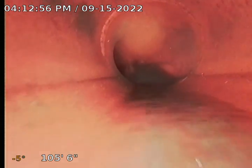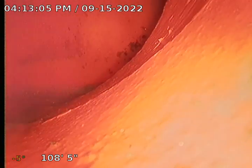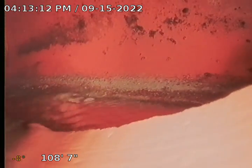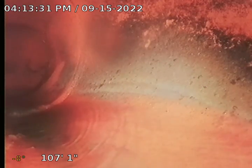It's getting a little bit tougher to push — I might have to turn on another water supply just to help push this. It's a manual pushing camera, a hundred feet out. When it starts to turn, that means I'm getting closer. That's it — that's the city connection, the city saddle. Your line dumps into the city here. I don't see any cracks or damage. My camera is a zero-degree camera so I can't turn it, but it looks good. I'm going to flush the toilet and be right back.